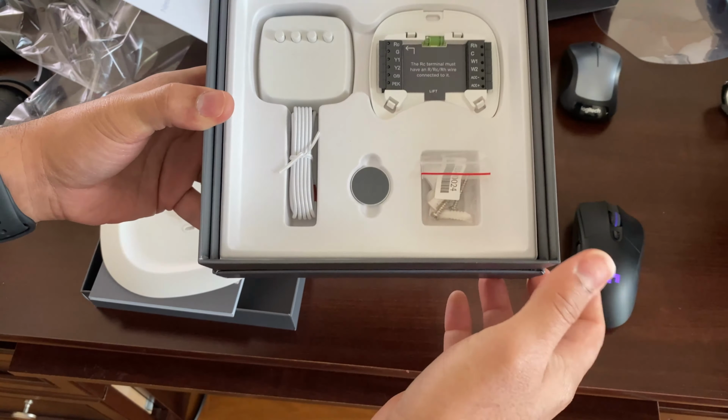Then go ahead and check if anything turns on by hitting the AC and fan on. Then you're ready to go. Pull the thermostat off the wall and go ahead and unscrew all the terminal blocks and just take it off the wall. Carefully take it off because you don't want to strip any of the wires. Make sure if you have stickers, leave them there because this way you'll be able to see it. Route the wires through the wall plate and the holder for your thermostat. It's two pieces, and kind of guess and check and look at how the wires route through it.